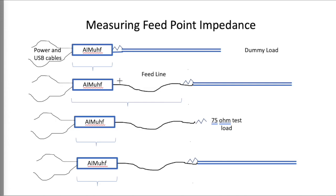To get around that problem, the idea is often that you will simply calibrate your test equipment to the end of the feed line — you connect an open, a short, and a known load, go through the calibration procedure, and this gives you the impedance of the feed point with the feed line connected, a more honest view of what your antenna impedance really might be. What I'd like to do a little later is explore a different way: leave the calibration point inside your AIM, put a known load at the end of your feed line to characterize it, and then subtract it out.